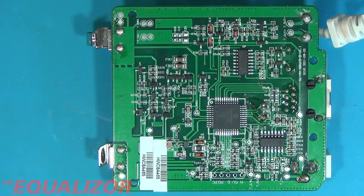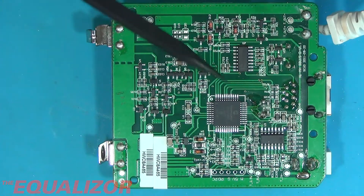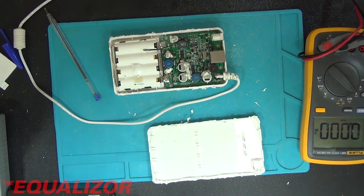So there's quite a lot of processing power on the bottom of the board. I'm very pleased to see a Microchip processor - I was expecting a generic unmarked Chinese 8051 sort of thing. The board itself looks really nice quality. Just as a battery backup monitoring unit, it's a really nice bit of kit - basically a 48 volt boost converter and a 12 volt output, which is presumably for the fibre to the premises box to keep it going during a power cut. I'm going to take all the components I want off it, and then it's going in a bin.